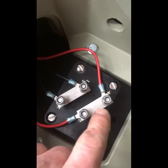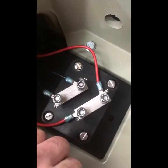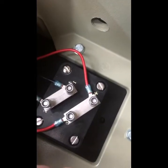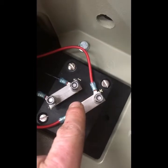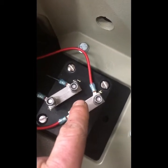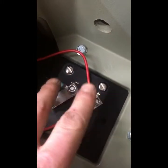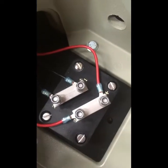There are slight variations. The old electro and the latest pattern electro both have their positive and negatives on the same terminals — one and four. The first version of the new style electro actually had these swapped round in our notes, but that's gone back to the original now. So as it shows you there: positive and negative clearly labelled, so you can't get it wrong. If you do get it wrong, when you test it you'll get a P on the electro instead of an E, and that will give it away straight away.